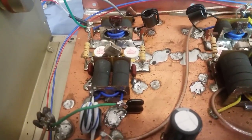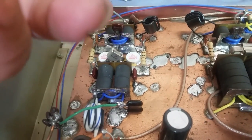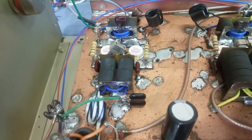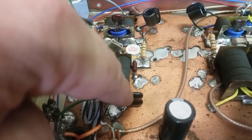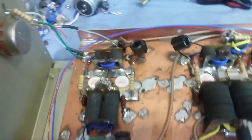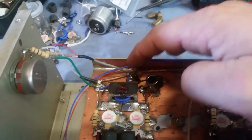I had to rebuild the 2-pill circuit for you because, like I said, this was a 2290 2-driving-8. Well, they didn't have a capacitor on the input, but I took the 820 off, put you a new 1000 metal clad on there for you. I took the output tuning capacitor right here, put you a DM19 150 on there, took the 330s off here, put you two 120s. I didn't have to put new feedback circuits on there for you, so I reused them. And the input tuning cap was just fine.